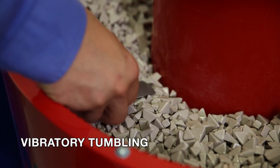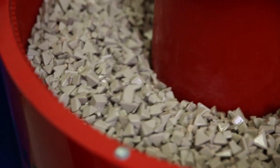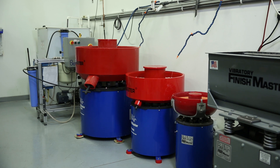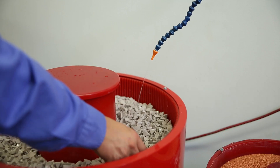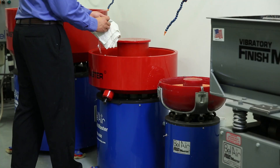The three-dimensional bowl vibratory tumbling method produces an isotropic finish. It is a lower-cost solution with little or no maintenance. This is a batch process where a quantity of parts can be run at one time, with a force of 1g and labor less than one minute per part.